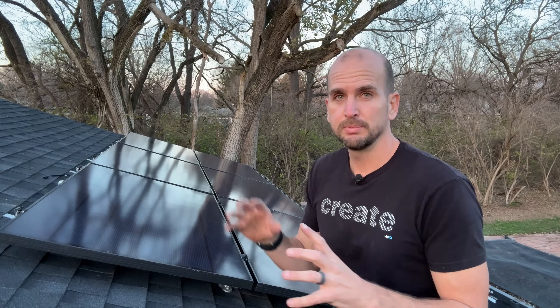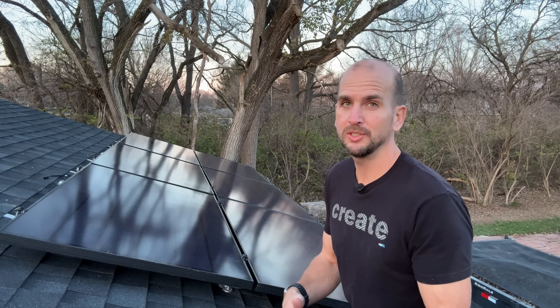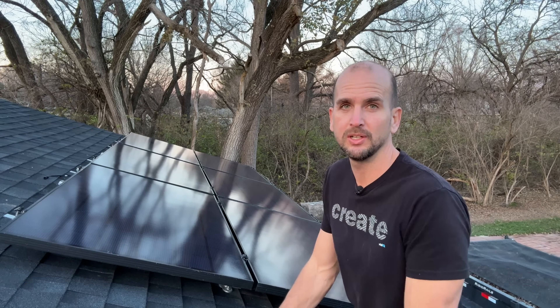You'll see a link in the description to where I got these parts, and there's also a configuration tool that puts together your bill of materials — how many of each component you need. Even though the mount is the main component, there are also spacers for the skirts, additional clamps, skirts themselves, and wire management accessories. Depending on where you're installing, once you do a roof mount there are building code regulations and NEC regulations you need to follow.